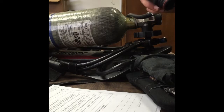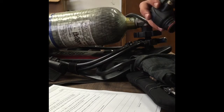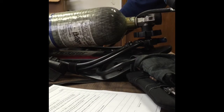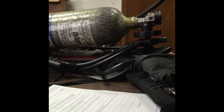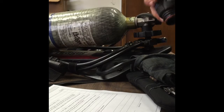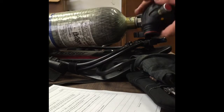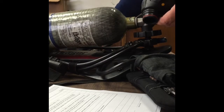The low air whistle alarm has to operate within 25% plus or minus 2% of the rated cylinder pressure. For the LDV we just need to make sure it goes into standby, which it already is, and then that the emergency bypass valve is working as well.